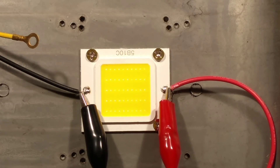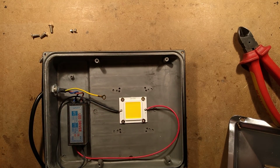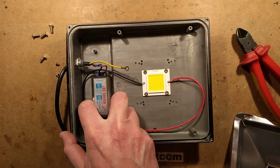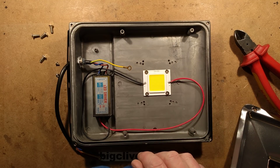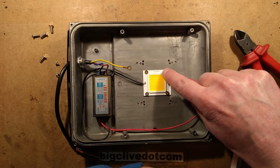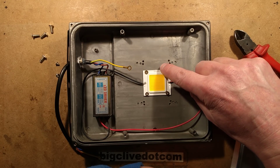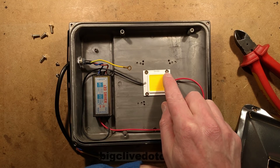This does look like the standard flip chip arrangement. I anticipated there might be a possibility this didn't come with the 50 watt ballast driver, so I've ordered some 50 watt drivers — hopefully they will actually be 50 watt — and I've found and ordered some of these LEDs as well. I wonder: 5B10C must mean 5 rows and 10 in series. I'm not sure what the B or C stands for, but I've seen 5B10C for 50 watt, 2B10C for 20 watt, and 10B10C for 100 watt cropping up a lot. So it must relate to the number of chips in the COB.